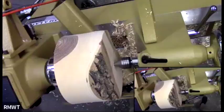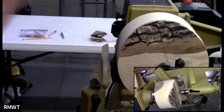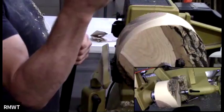No, we don't have torn grain because of the grind. It's nothing to do with the technique so much as it is to do with the grind, because we want to slice and peel. If I say, oh, you've got a little bit of torn grain showing up, they say, oh yeah, time to sharpen. That's the only time that we have torn grain with push cut.